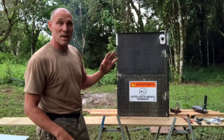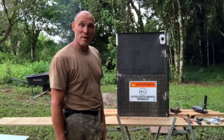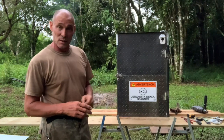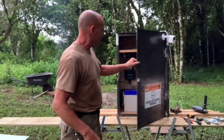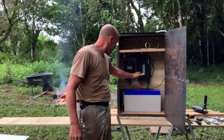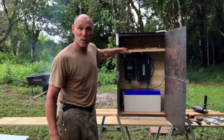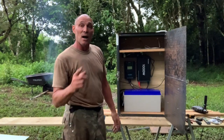It is the end of the second day and we've finally got our box all set up. We've got a security camera right here and a sign warning that the area is under video surveillance — hopefully a deterrent for anyone who might try to climb the tower. Inside we've got our battery, inverter, charge controller, a plug strip for the cameras, and a shelf for a router or anything else we might add later. It's looking pretty good — let's get an up-close look.